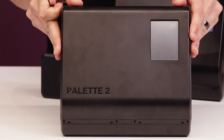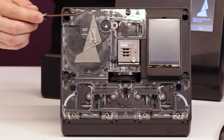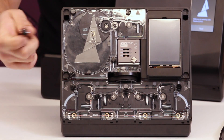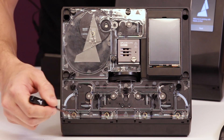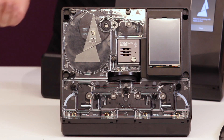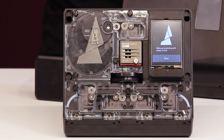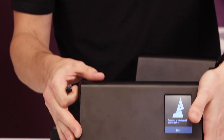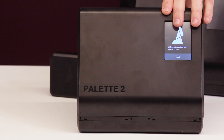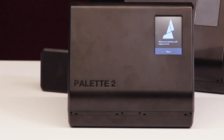So I'm going to quickly go over what I need to do. I've got my Palette 2 Pro here. If I pop off the lid, I've got a new Splice Core to install. These acrylic panels come off with the thumb screws. Under the acrylic panel, I'm going to have lever arms — one, two, three, four, five — and I'm going to have those switches. Swapping those out and I'll suddenly have a Palette 2 S Pro. It's a pretty simple upgrade — way easier than a hot end swap. I now have 99% of a Palette 2 S Pro; that other 1% is the faceplate, which still says Palette 2 Pro. But the insides are really what matters — and on screen it'll remind you that it is an S Pro, as it is a different firmware entirely.